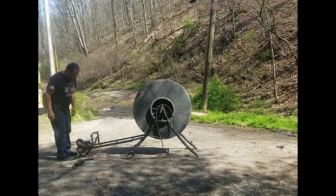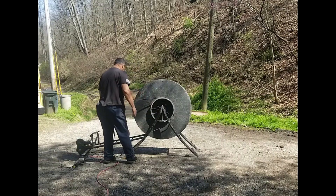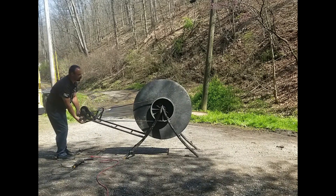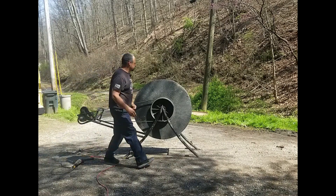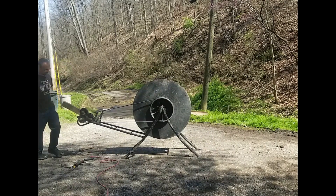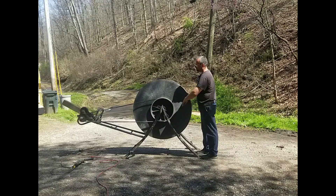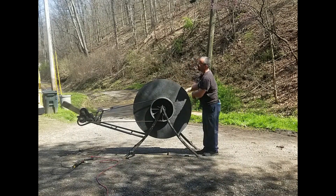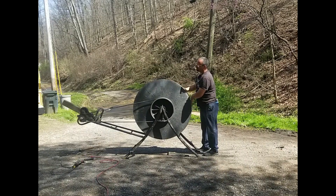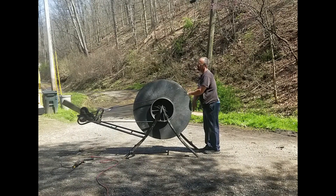What I've already tried to do is put the generator where the lawn mower gearbox was, at the same distance, so that the belt tightens up right there. You can see it needs a little more weight on it — there we go. You can see this pulley is turning the other pulley which is turning the generator. But it doesn't turn nearly as fast as the wind generator used to — I'm getting about eight volts out of it at this speed.